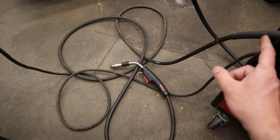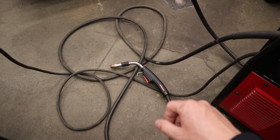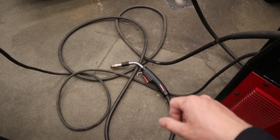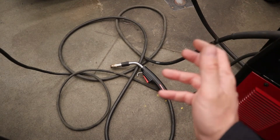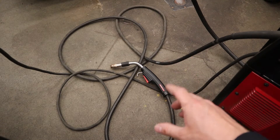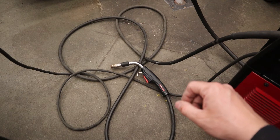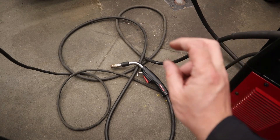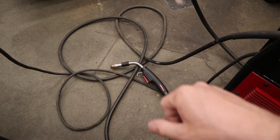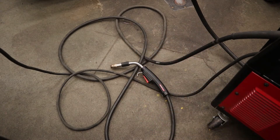The third cause is the liner. The wire feeds all the way through the liner to the end of the contact tip, and if anything is resisting the free movement of that wire it's going to stop it and cause a backup — a bird's nest. This could be an old, worn-out liner, rust inside if you're welding outside, or a liner that's been damaged — maybe someone rolled a dolly over it or bent it at harsh angles.